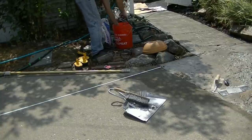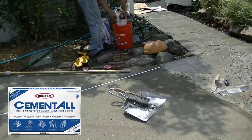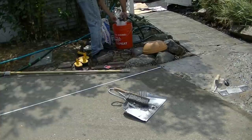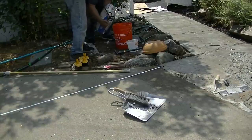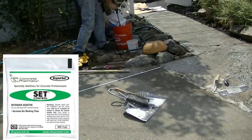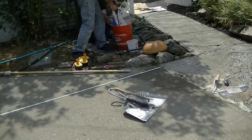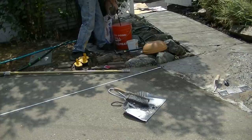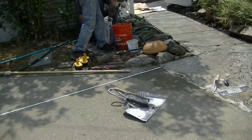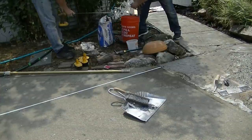For the repair material, you can see that blue bag behind me — it's called Cement All, from Rapid Set. That stuff dries really, really fast, but it also repairs concrete like this really nicely. They do make a little pack called set retarder that slows the setting time down, and we are using a little bit of that today. It comes in a small package and you buy it right at the store that sells the repair material — Home Depot sells this stuff. One of those packs will give you a little bit more working time; otherwise you're only going to have two to five minutes of working time depending on temperature.